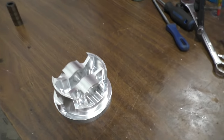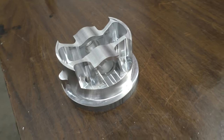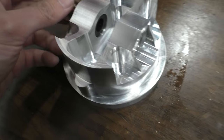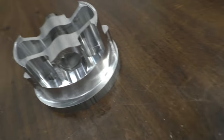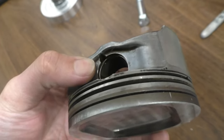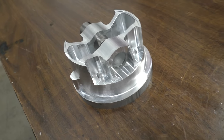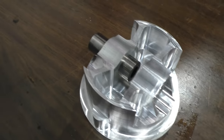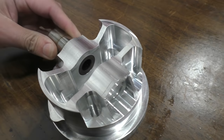Here's a look at the piston after the sides are machined — you can see the wrist pin hole and the wrist pin retainer grooves are also machined. The wrist pin goes in fairly firm right now, which is something I might change for the final pistons. I also haven't left a groove for taking out the retainer like these Mercedes ones had — something I might also change to make it easier to remove the retainer clips. For this prototype, I didn't bother making that extra effort, but for the final ones I'll definitely add those steps and probably open up the clearances for the wrist pin.